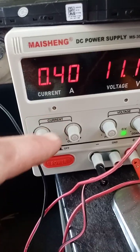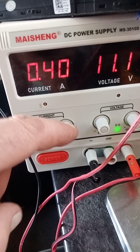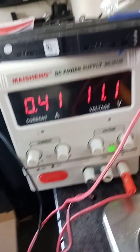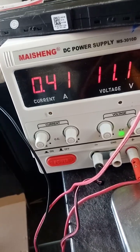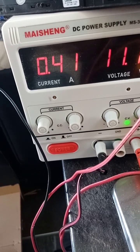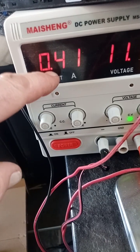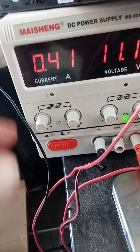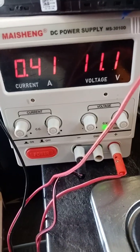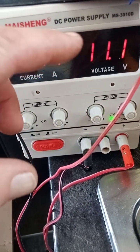Now, if you haven't and you are stuck with this one, here's how to use it. If you're doing voltage injection, like this, it's stabilising the amps itself. If you had a fault, like if this wasn't charging the battery, or the battery was completely shorted somewhere, or you're in a laptop with a short, the CPU's gone or something, the amps here would go off the scale. And it's the same the other way around, if we're injecting the amps. To bring this battery back, I went the other way and injected amps, but did it where it doesn't exceed the volts. And the same here.